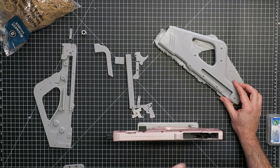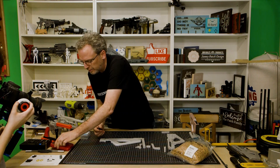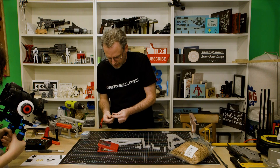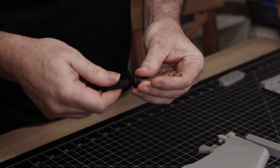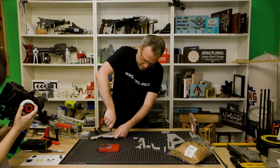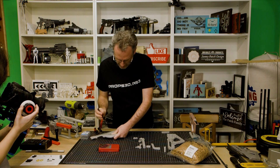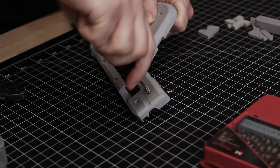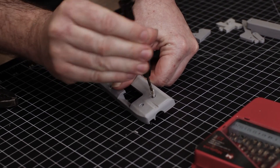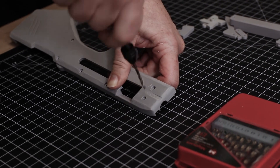So the first thing we're going to do is actually drill these out for the M3 screws. I'm just going to use a little hand drill for this. I like these quick hand drills because they don't really damage the parts and they do a really good job. This is a 3.2 millimeter. I'm actually going to start with 3 and then see if they slide in nicely. My Prusa actually prints these at just about the right size, but my CR10 has a bit of a different extrusion on it, so it tends to make these a bit tight. I've sized them exactly right on the 3D model, assuming that everybody's printer would be a little different.